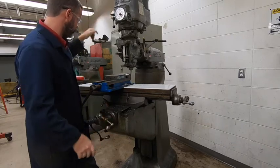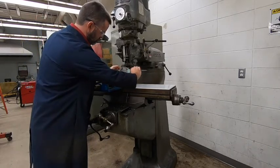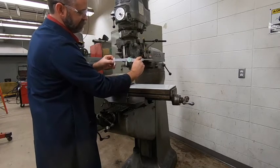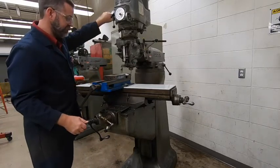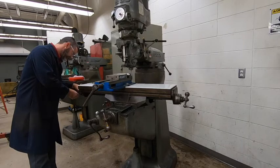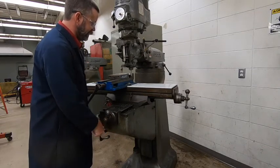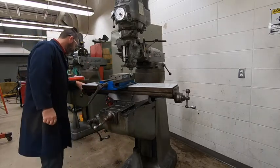We'll shut it down and get my caliper out. Make sure it's on zero. I am sitting at 3.115 — so I've got quite a bit to go. We can do multiple passes, probably two. I'm going to move it in that 30 mark. I'm going to do a pass — because I had 0.115 to take off, that was 30 thou. I'll go in another 30.